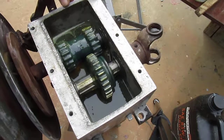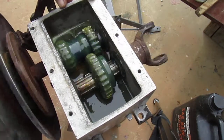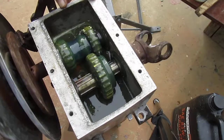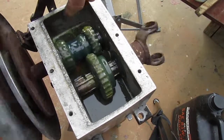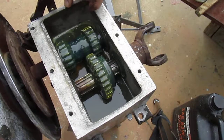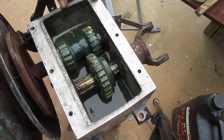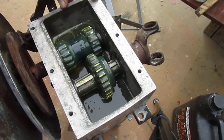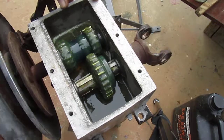So I kept adding more oil until I started seeing some on these bearings. I think when you get more speed on this, it'll be turning a lot faster and more oil is going to land over here on the far side, so it probably wouldn't hurt to have even a little more oil than this. This is an 85W-140 — I figured it could use the cushioning and the heavier oil won't hurt anything.